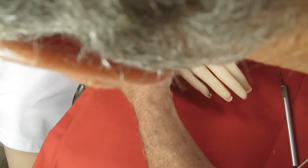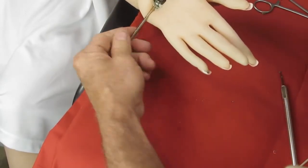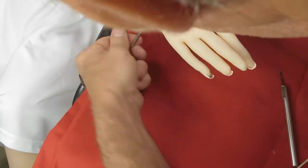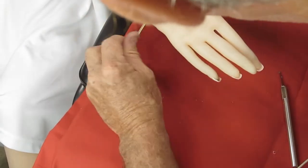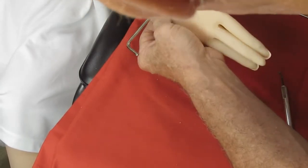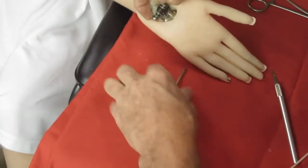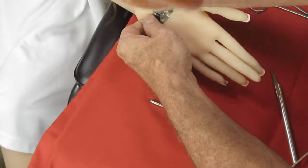As you can see on the wrist hinge here, they use the Belleville type spring washers, which facilitates an even pressure in the hinge joint of the doll. A lot of manufacturers, from what I understand, don't do that. WM seems to do that. All of the hinges that I have seen, they have pretty much incorporated this feature.